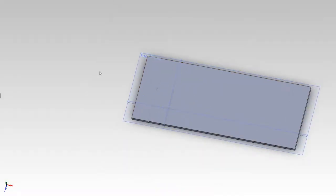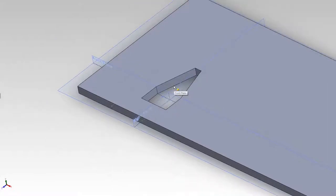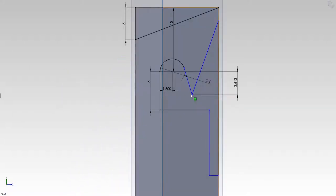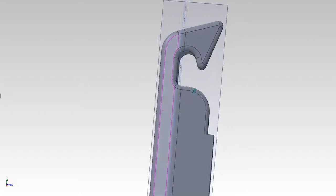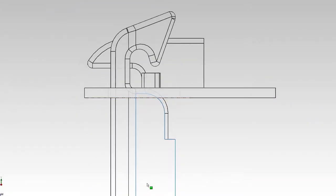Looking at videos and images of these machines, I started by setting the half pitch distance between two needles, made a hole for the needle and also two prongs and a hold-down section, and then some fillets to make it all neat. I started the needle with a section to fit in the hole as well as a few different features that looked important, and then I looked at the design from various angles to make sure it made sense.